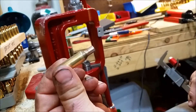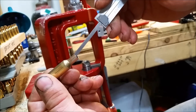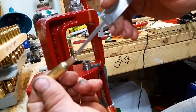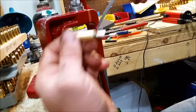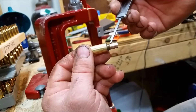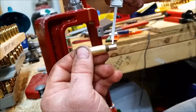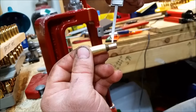As soon as you get there, it jumps up to 16 to 18 thousandths, plus on the inside you have a thickness ring. So while this is just formed, you haven't run anything through the inside — you're going to have a little extra thickness on the inside. That's why I like to ream right now, because it's pushed in on the inside. Now I can ream the inside and trim at the same time.